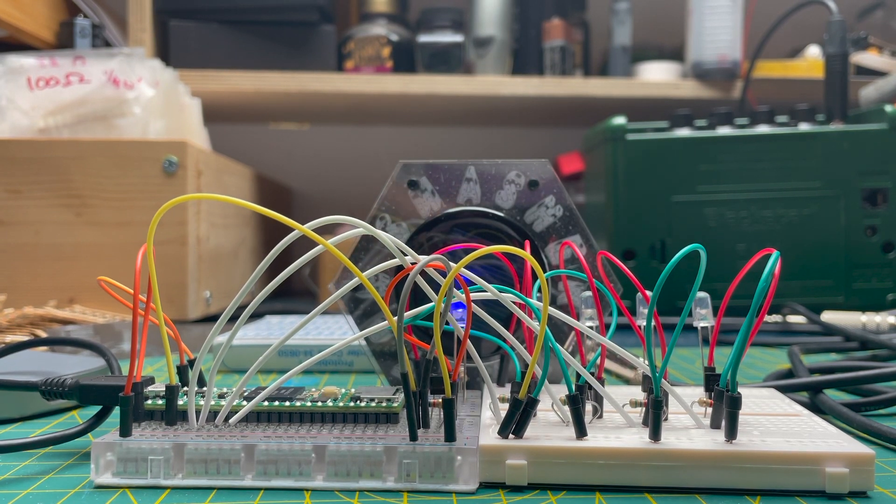We got a prototype working using those LEDs and then hooked it up to MIDI as well. Having prototyped the small version, it was time to step it up. In that earlier version, the LEDs are being driven directly from the Teensy circuit board itself. But the Teensy can't put out enough power to drive one of these bigger 12-volt LEDs. This meant the circuit is a little more complicated — the Teensy is driving a transistor, which is driving a MOSFET, which is controlling the 12 volts going to the light. MIDI from Ableton is sent to the Teensy, that MIDI note becomes a frequency, and that frequency is sent as a PWM signal from the Teensy, modulating the 12 volts to the light.